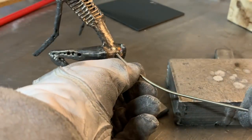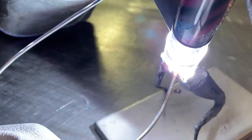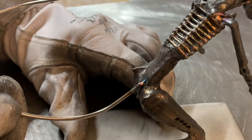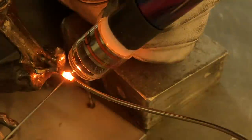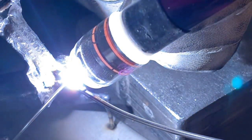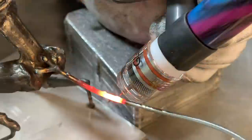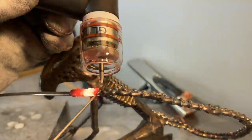Now it's tail time — I'm excited for this one. I've got to make a rough frame to follow, and once I've got the rough frame laid out I'm going to tack it in place. Now you are seeing the start of a very long process. I don't want to heat up the tail too much or else it will break and fall off. So I've got to spread my dabs out strategically. This is all done with minimal amps and I'm literally welding on the surface of TIG welding rod, so I've got to be real careful here.